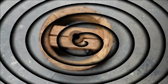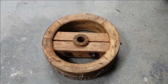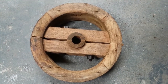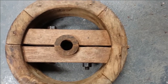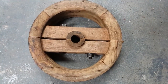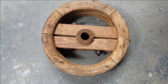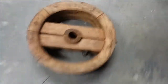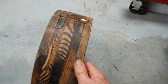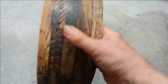This is also quite a nice one. It's much smaller — about a foot across, about 30 centimetres or so. You can see the central wooden sleeve there for clamping it onto a shaft of a certain size. It has only got the one main spoke; it doesn't have secondary spokes. And as you can see, the bolts go in from different directions on this one. On these smaller pulleys the bolts tend to be captive — you can't get them out because they're constrained by the rim of the pulley, which means it's harder to clean them up with a wire brush, but it also means you're not going to lose them. You can see the structure of it much more clearly — the way that it's been built up in sections. It came from a cider press.